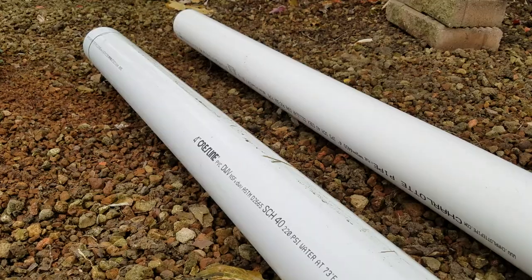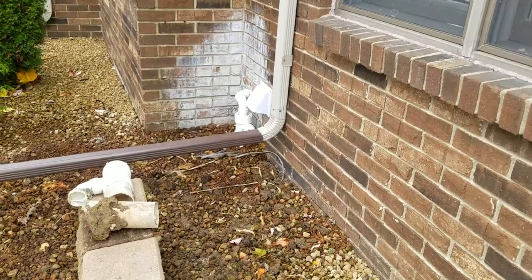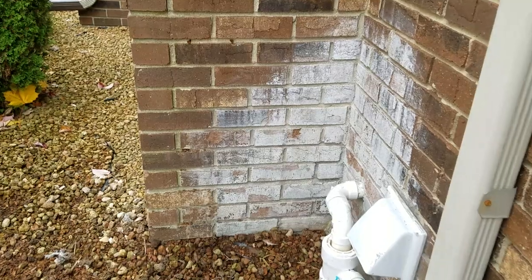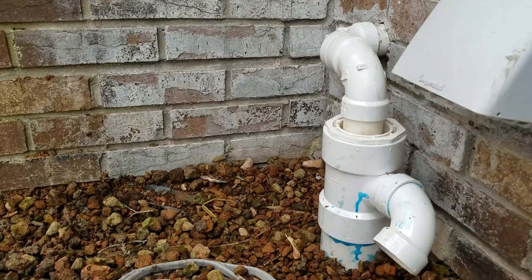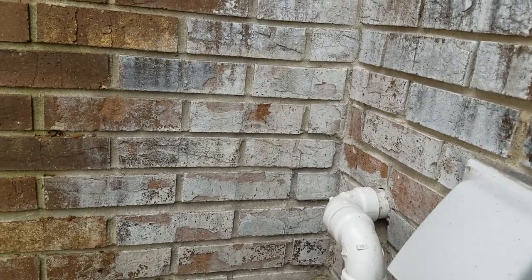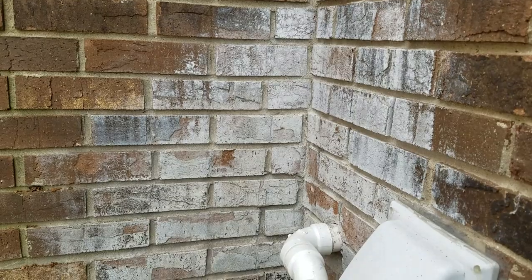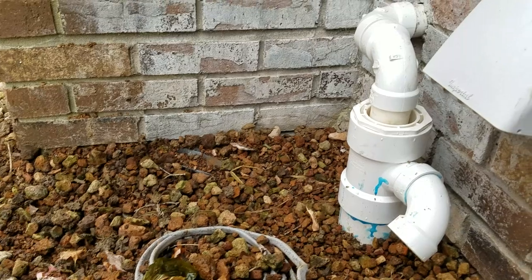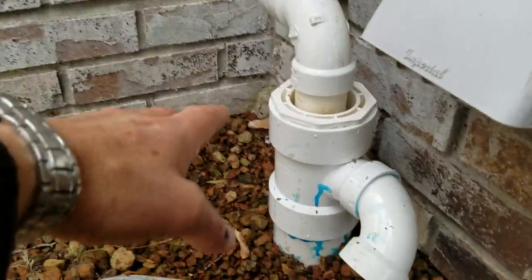Plus you've got the heave and thaw. This is a shallow system — we can't get it below the frost. We're taking it out to a ditch; this is referred to as a sump line out to daylight. It's shallow, it's going to be in the freeze-and-thaw cycle. Up here at the house, when the old line failed it was just spraying on the house. You can see all the efflorescence in the brick that has come out from all the water spraying against the house. There was a big erosion hole right here as well.